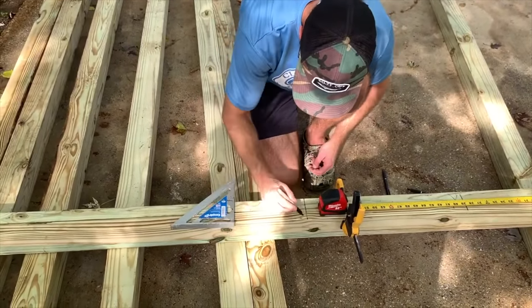So in order to cover this last row of nails, what I did was I took a bunch of asphaltic roof coating and I used this as a type of adhesive. And then I took another row of shingles and I installed it pretty similar to how you would install any row, but the only difference is I nailed it through the shingle as far as I could up towards the ridge and still secure it to the fascia board. Now, we're gonna have these exposed nails, but we're gonna install a piece of flashing over the corner there, which is gonna cover those nails, so it's not a big deal.